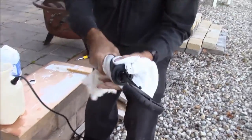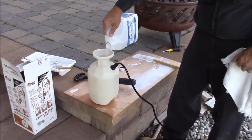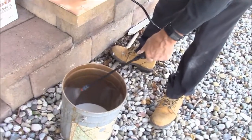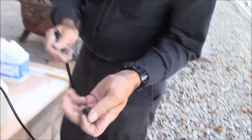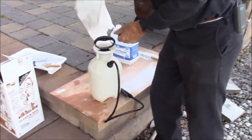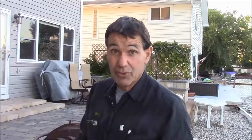Make sure you get all your gaskets clean. Just because they're up high in the tank doesn't mean you can leave anything in there to ruin your day on the next pass. See — nice and clear now. I may leave a little bit of thinner in here since I'm coming back to this job. Here's my nozzle — there could be a little bit of paint hiding in here, so I like to take it apart and make sure it's clean with a little thinner. We did a good job, ran a lot of thinner through here, and these are looking fine. When I come through my next job this should be all set up, and I'll put my second coat on this wall.